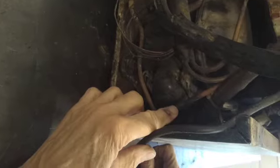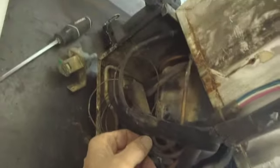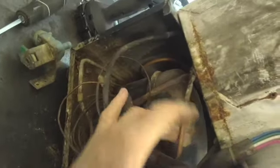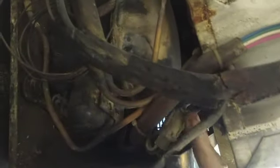There's a joint here. I can unsweat this, and then this other tube goes to the dryer. So we're going to change the dryer anyway. So if we disconnect these two tubes, that'll disconnect the cabinet from the top. And then, of course, little brackets and wire clamps. There's another Molex connector here. This is probably for the drain heater. So then you can get a look in here and see.